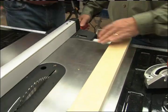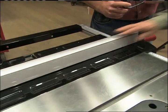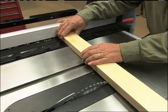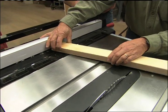What about when we're doing a cross cut? One thing you never want to do is use your rip fence to cross cut a piece of wood. You can't control it — it will bind up and will definitely kick back at you, in some cases taking your hand over that blade.